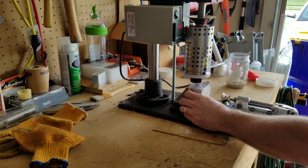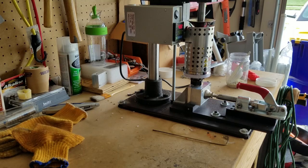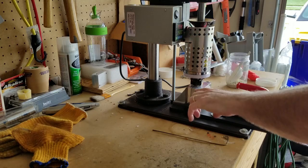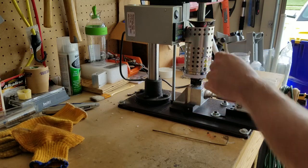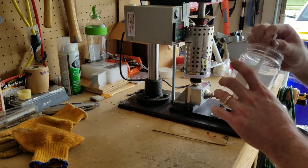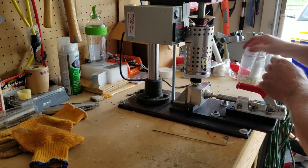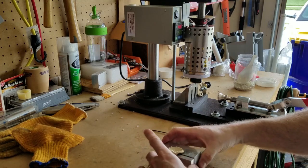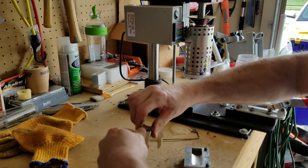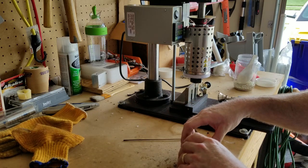Take your mold, slide it in until it stops, lock it down, pull the handle until you get some pressure — that way you know the mold is full. Give it a few seconds. The LNS has this blinking light to let you know everything's working properly. For ABS and most of the plastics I use, if I let that light blink seven times — about 14 to 15 seconds — that's enough time to let it solidify. Then fill the hopper and release the mold. I think I might have that too hot now because it's leaving a lot of material on the top.